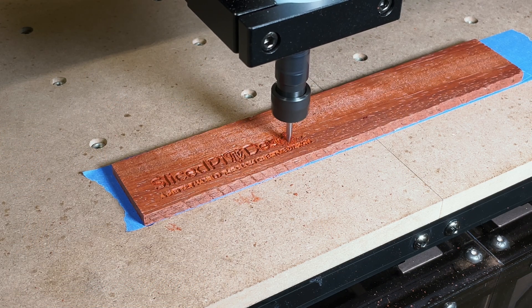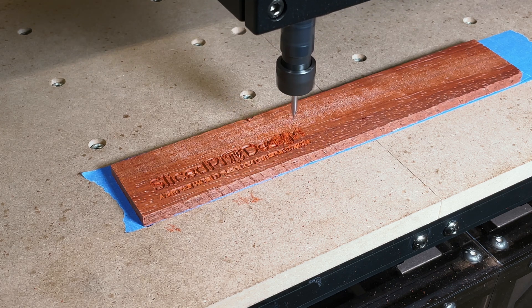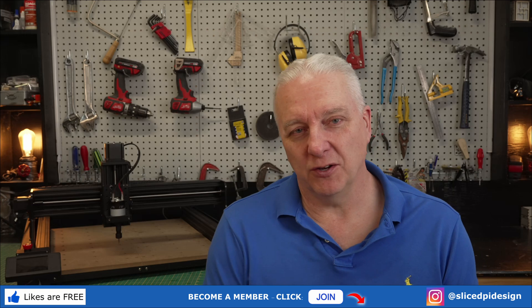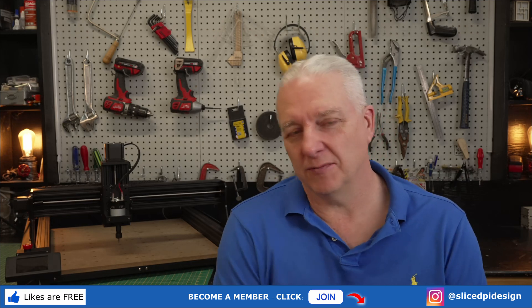As always they could make it better, but I am really impressed at how good this CNC is for the money. In summary, we have a CNC that — once you've managed to get it assembled, which was the biggest challenge — you end up with a really nice machine that generates very high quality engraving. I didn't try cutting, but engraving looks very nice. It's much better quality than the 3018 — more like the entry level of the higher-end CNC category. The stock 500-watt motor is actually very good, and I'll do an upgrade video on that in the next week or two. If you want to compare this to something like a Onefinity, I'll put a link to a review video above. Get out there and make your world — I'll see you next time.